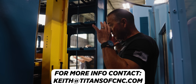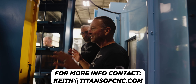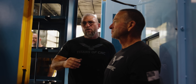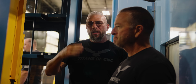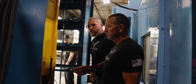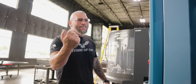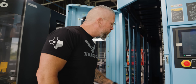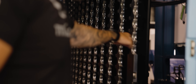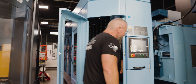This is all driven for lights-out manufacturing. When you go to lights-out and have a 40-pallet system, you need tools. This machine has not only the 40 pallets integrated into a vertical stocker, but all your different products stacked up and set up for true lights-out machining that runs non-stop. Check this out - the matrix tool storage: 530 tools, and they all sit boom boom boom all the way down.